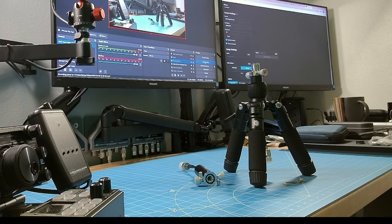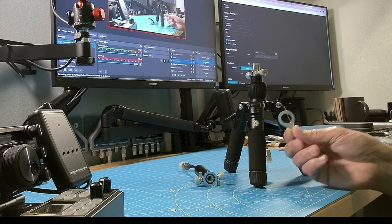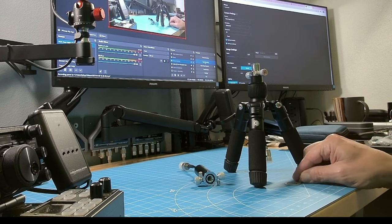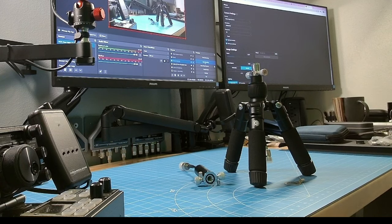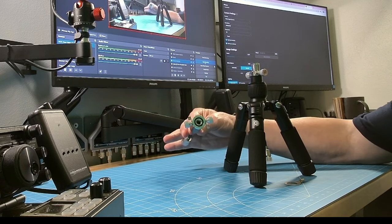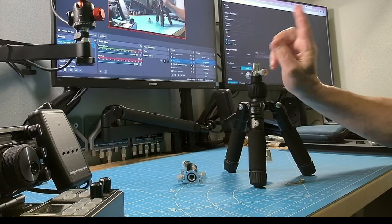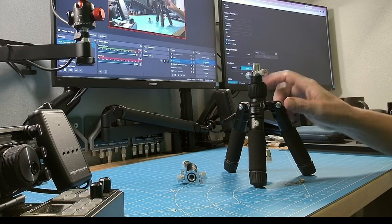Version three, just recently introduced, has two major changes. There is a significant change to the way radials are connected, which is a significant improvement, although the other way worked fine. And then there's a massive change to the post for the 3/8x24 antenna systems. We're going to go to the overhead cam so we can get a closer look at this.